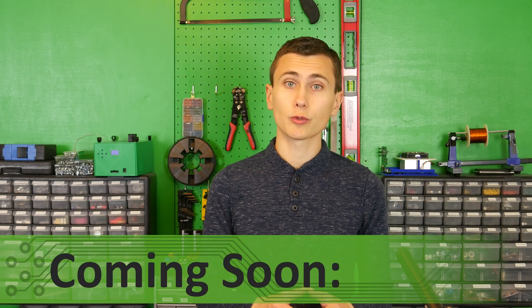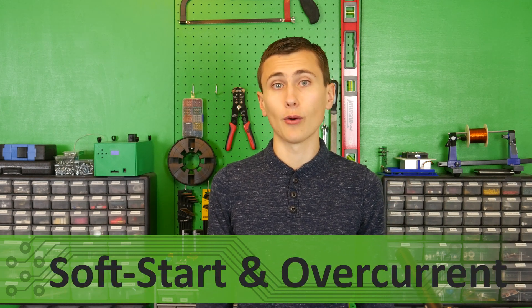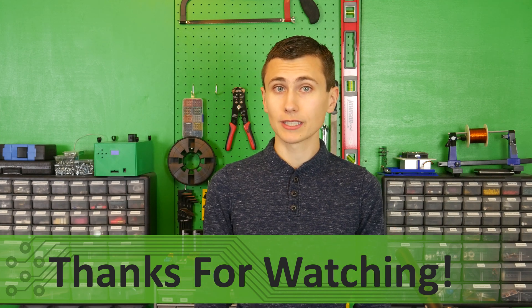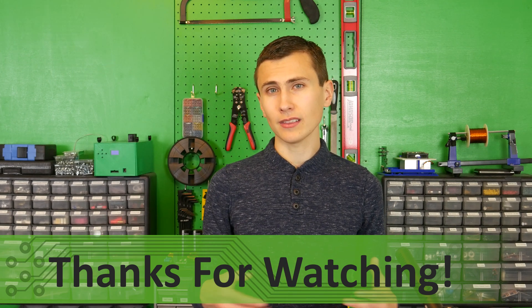Nevertheless, we need to push onwards. Let's take a couple days to think more about this snubber, and even if this is the best we can do, I'll grab a 12-volt high-current power supply so we can push the limits of our UPS at a lower input voltage, like 12 volts 30 amps. If you like what you saw today, consider subscribing to be notified of future videos where we'll load test our best implementation of this push-pull converter and test our inverter stage's soft start and over-current hiccup routines. There's always something to learn when implementing power electronics like this — many little details can sneak up on a person if not careful. If you think you learned a thing or two about snubbers at my expense, let me know by hitting the like button or leaving a comment. I hope to see you again soon!